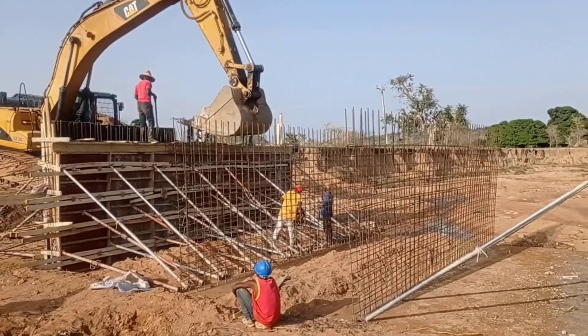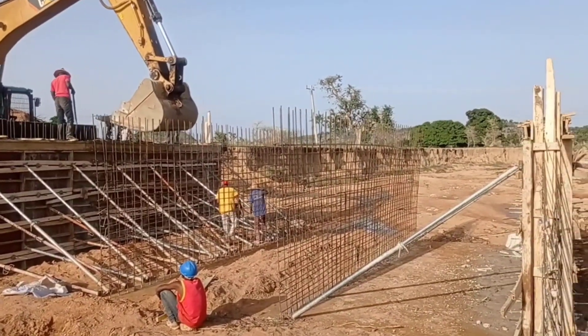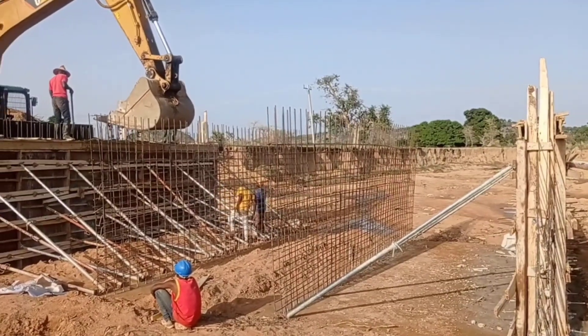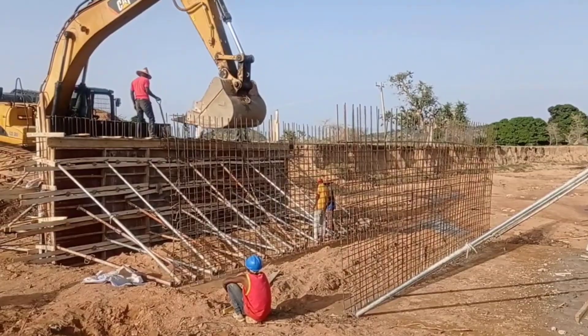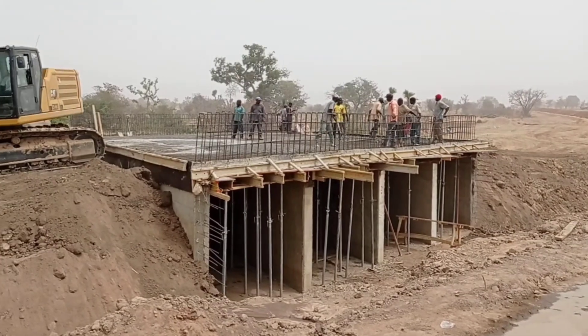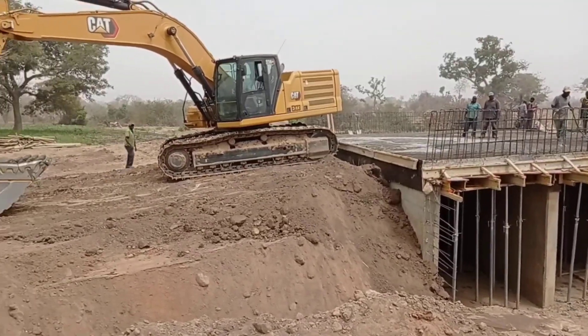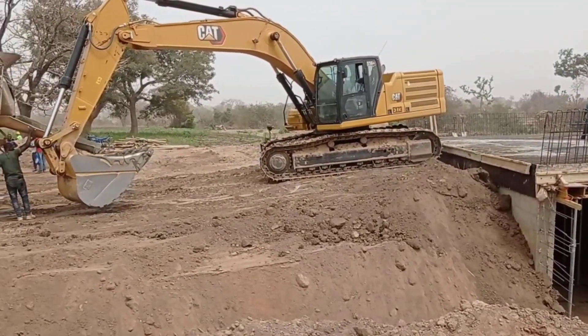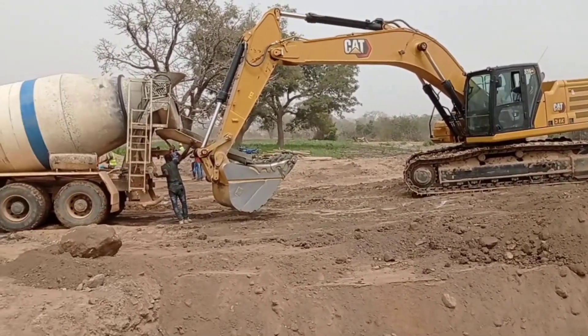We are expecting a large flow of water, which is why a proper construction of culvert was done. Before you start constructing a culvert, it is always advisable to study the area. The cross-sectional area from where water is flowing can be studied so that it gives you an idea on how to construct and design your culvert.